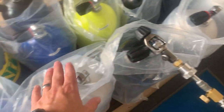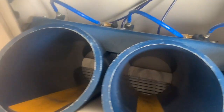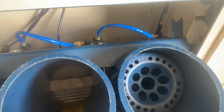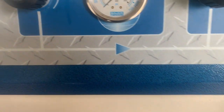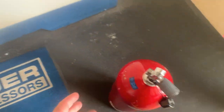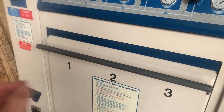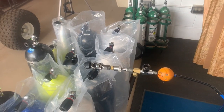I just finished up this tank here. I'm actually going to swap the fill adapter over to the next one and show you how we do a single fill. Then I'll actually show you how we do a multiple cylinder fill by using these sleeves in here. One of the benefits to that is if you have an empty cylinder and you've got a semi-full or half-filled cylinder, you can actually balance the two out by putting them in, equalizing them out, and then fill the tanks equally without having to do them one at a time.